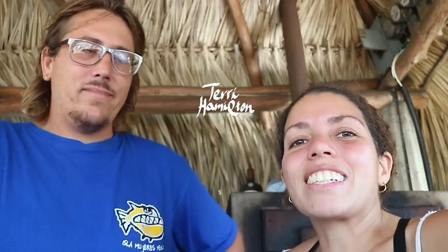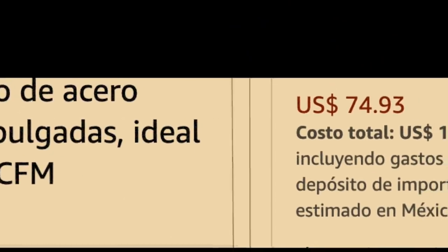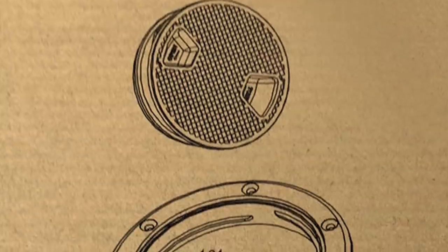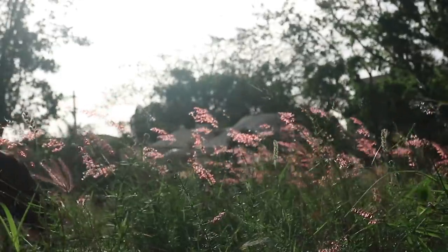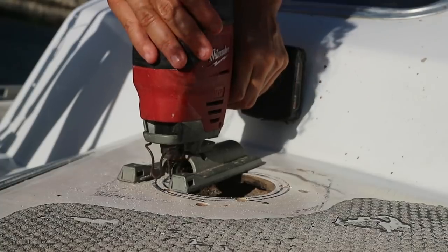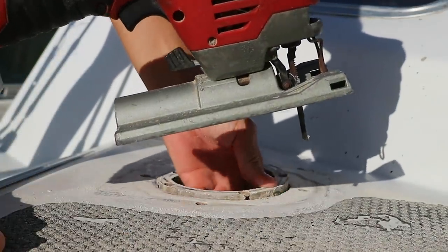We had these two huge holes in our deck where I removed the rotten air vents. The electric solar-powered vents cost about $100 each to ship here to Mexico, so it's just not worth it. We are going with some simple inspection hatches — easily removable, easily installed — and we can open them whenever we need some extra air coming inside. I will cut taking into consideration the structural integrity of the surrounding area, not cutting too close to the chain plates.